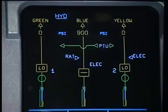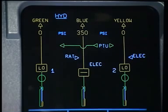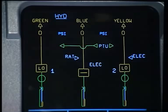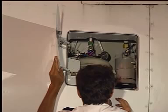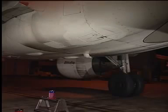Electrical power being available, on the ECAM, check that the blue system pressure shows 0. If not, operate the rudder to reduce the pressure to 0. Safety and tag the appropriate circuit breakers. Check that the blue reservoir pressure and the accumulator pressure are normal.